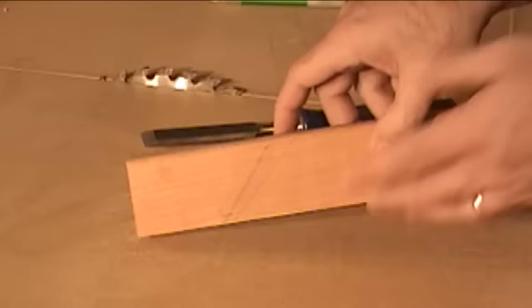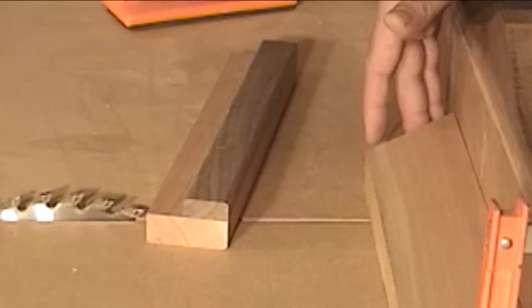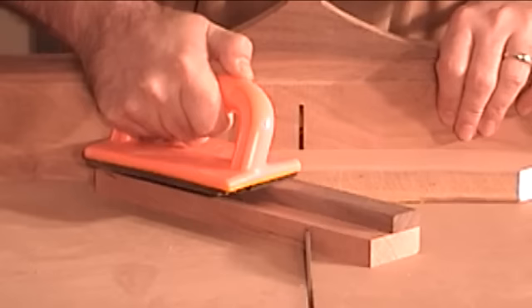In order to safely make these cuts, I'm going to use my table saw sled, and I set my blade depth so that the blade will only cut through the cherry and leave the walnut. In order to cut the 45-degree angle, I'm going to use a sacrificial piece of wood that has a 45-degree angle cut on one side. Because I didn't quite cut all the way through the cherry, I'm going to need to raise the blade just a smidge.